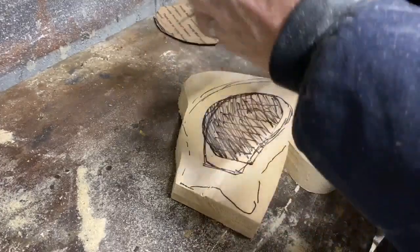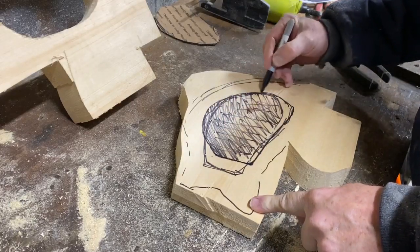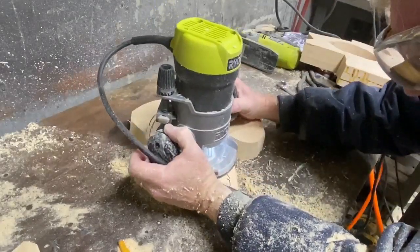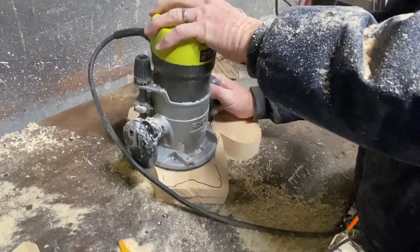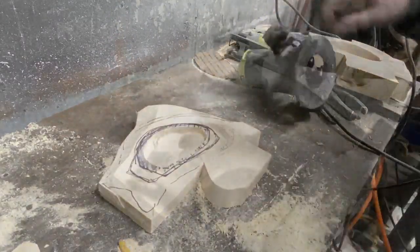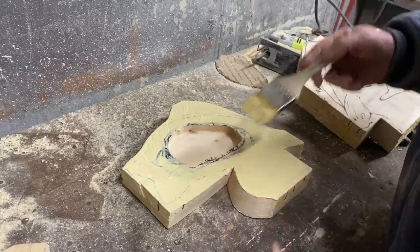On the section of two pieces of wood, I did the same thing — I outlined it and marked it with a Sharpie. But instead of drilling all the way through, because this is going to be the front panel, I just used a router and routed out about a half inch of material. It gives the birds a little bit of extra room for their nest, but still gives me the ability to do all the detail and carving of the fish without breaking through to that opening.